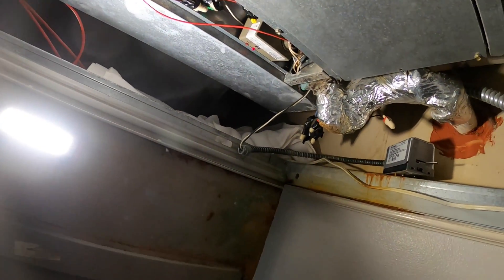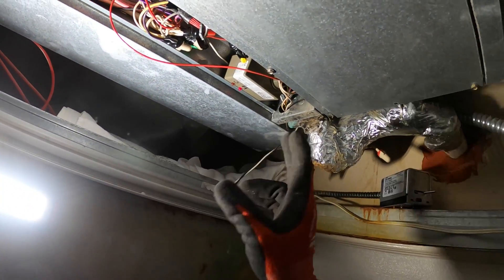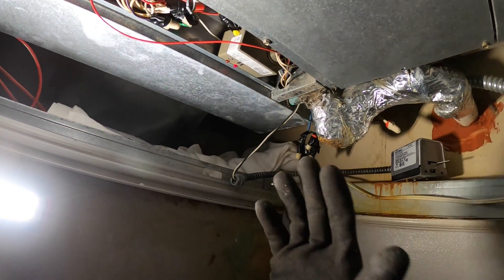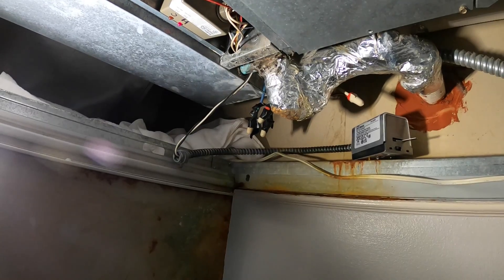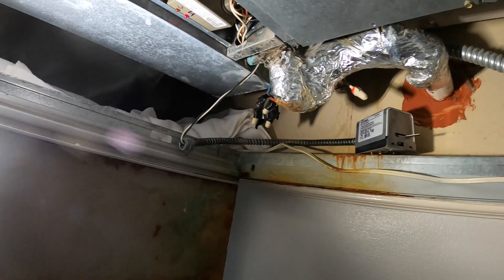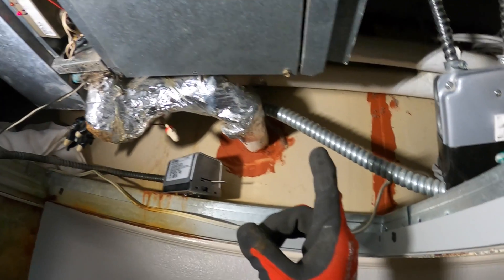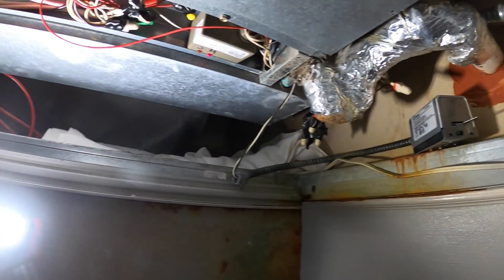Electrically this is working. But without even having to check temperature, I already know that because this valve is squeezing through, we're mixing heating and cooling, and the cooling overpowers these electrical heaters. In that case we just need to replace that valve. I'm going to go with the method I described: prop this on open and cut into this line. It's going to be a fun day.